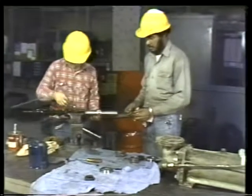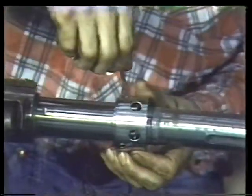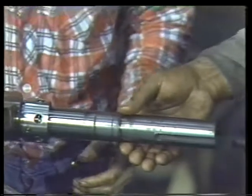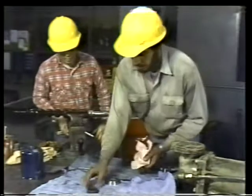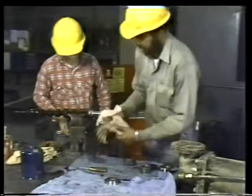First, the new collar and cartridge assembly, which contains the spring mechanism. It keeps the carbon and metal sealing surfaces in tight contact. Next, the rubber O-ring that fits against the spring mechanism inside the cartridge. The last rotating part is the carbon sealing face itself.